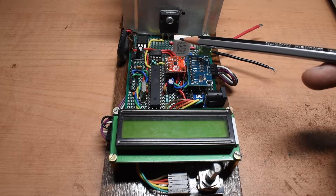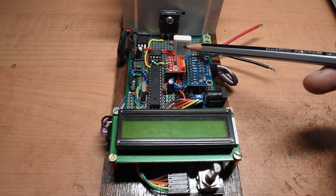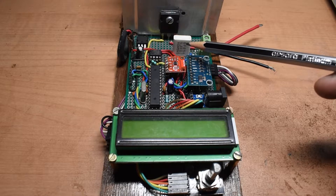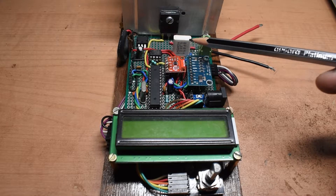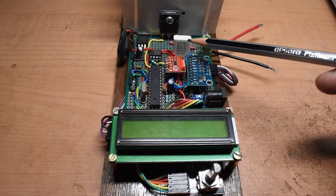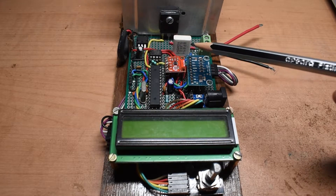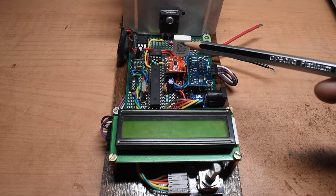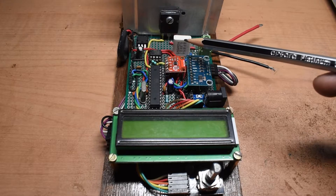The second change is I have used a 0.1 ohm 5 watt resistor. This is a 5% resistor and I was looking for a 1% resistor but couldn't find one. I assume it will work fine at lower current values but towards higher currents I might get some errors. I won't be measuring huge amounts of current — probably a maximum of 3 or 4 amps. If needed I will upgrade to a better shunt resistor.